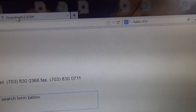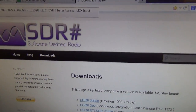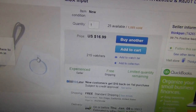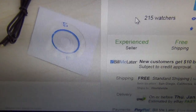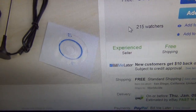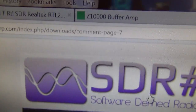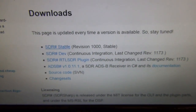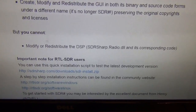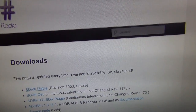You can get the drivers, and by the way, the drivers for the dongle come with — as you can see there's a little CD-ROM right there. Don't load that. It just doesn't work. Don't do that. Go to the SDR Sharp page — they've got drivers there that work, plus little utilities to help you make sure that the dongle is working correctly. And that's the big thing as far as the software side of this.